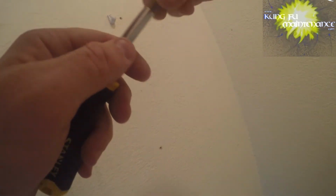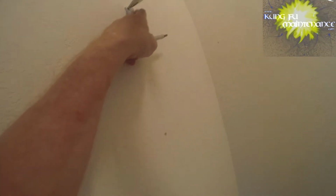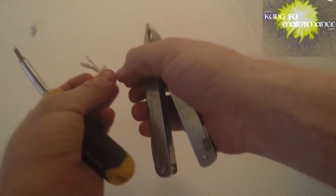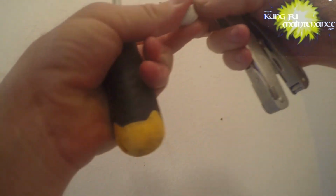But to make these stronger, if they're anchored in a stud, there's an alternate way of using the clips. You have to just cut off the clips and then put the screw in a stud instead. And the same with the support arms. Sometimes those are anchored in a stud instead of using these special clips, but these clips are designed to add considerable strength in just an anchor to the drywall alone. Anyway, this is how you can remove them with about the least amount of wall damage. Just thought I'd cover those other points.